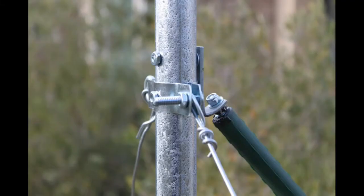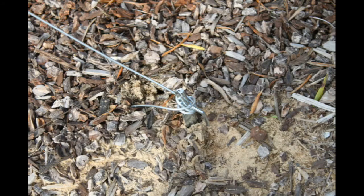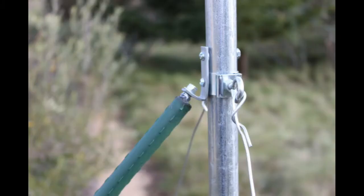What I did was attach two guy wires to a conduit strap on the pipe near the top and stake the other end of the wires in the ground with tent stakes available at the hardware store. My problem is I'm on sandy soil, so the stakes really don't hold very well. Also, since the weather station is at the edge of my property, I can't put a stake out on that side.